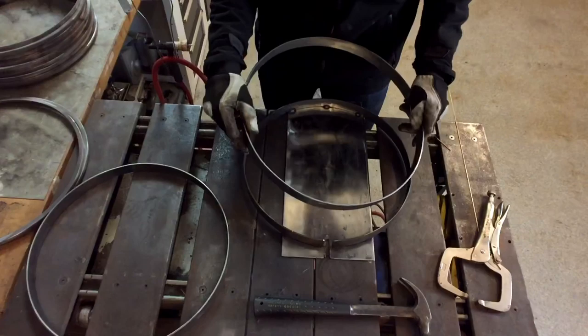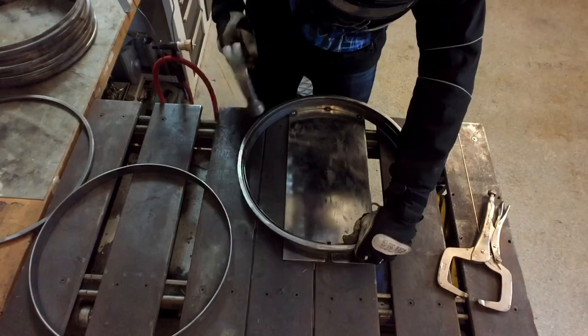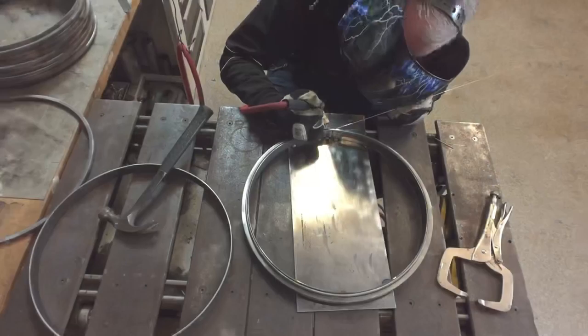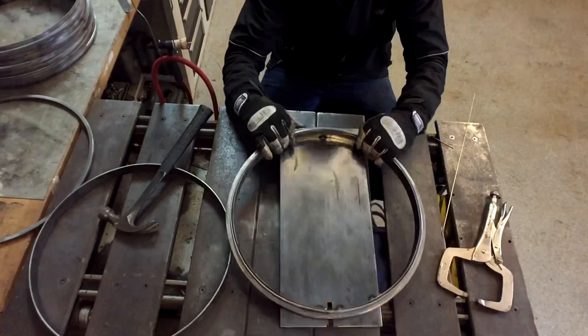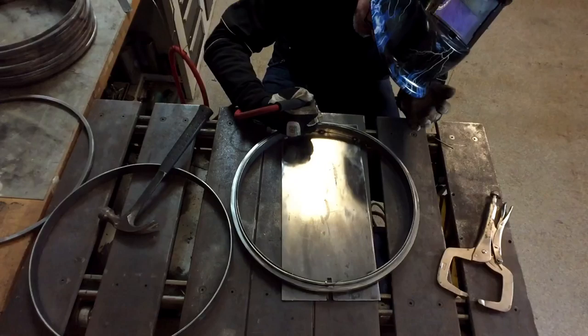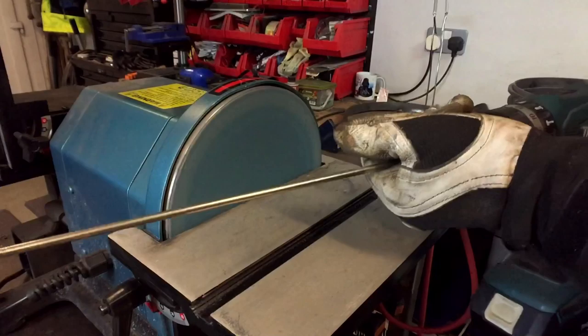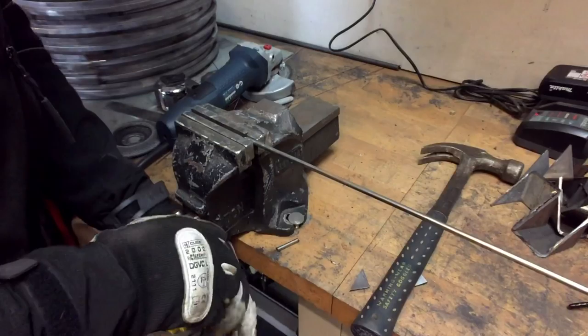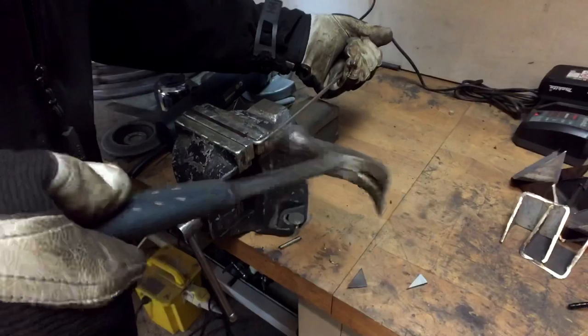Using the jig again to join the flat bar with the square bar — it's a relatively straightforward process, though I did need a little bit of help from my smallest persuader in the tool chest. Squaring all that up and tack welding them in place was an easy job. Putting some 6mm round bar into the end of the battery gun and spinning that up against the bench grinder meant that I got a lovely little point onto the pointers. Then simply bending and cutting to the right lengths meant I got uniformity across each of them and across all the clocks.